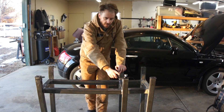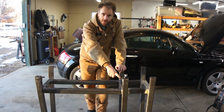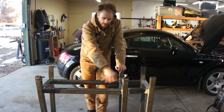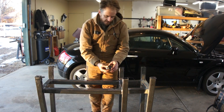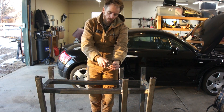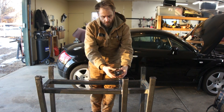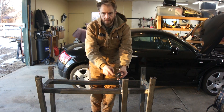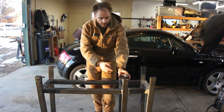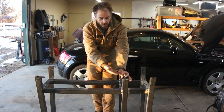I had originally planned to use these 90-degree weld tabs as the feet, and the more I thought about that the less I liked it — it's going to make it very difficult to accurately level this whole thing. So instead I've decided to use some square plate. This square plate has a hole in the middle and I've put a bolt through that with two nuts. What I'm going to do is capture this inside nut, flip it over, and weld it into the leg, and then I will be able to use the bolt and this second lock nut to raise or lower the table.